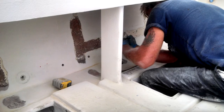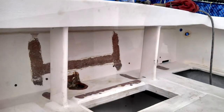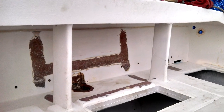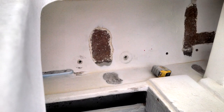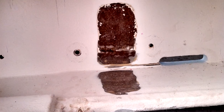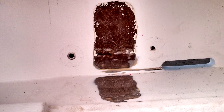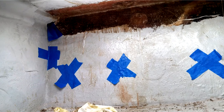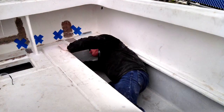On the reverse side of the transom, there was also a huge amount of work going on. You can see here that Brian has sanded away the spots where we plan on installing our new live well. Notice the bare spots to the left and right of the live well — this is where we will install elbows in the corner to add strength to the floor-to-transom connection. This same connection is a concern below decks as well. So upon John's advice, we laid up an additional five layers of woven roving to make this area of the floor really strong.